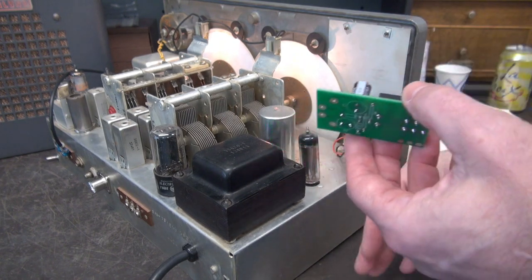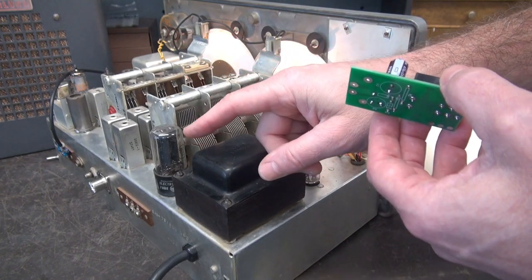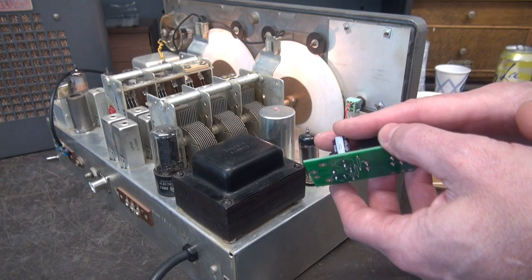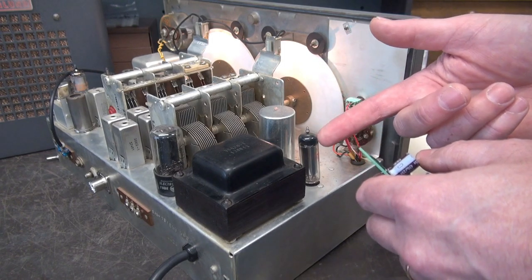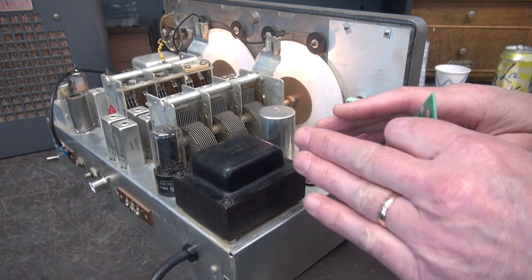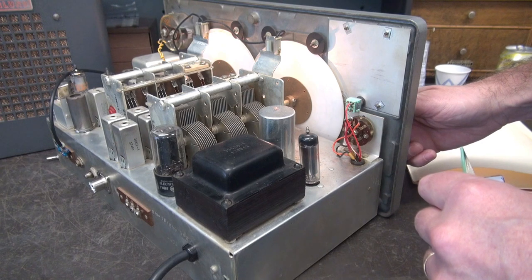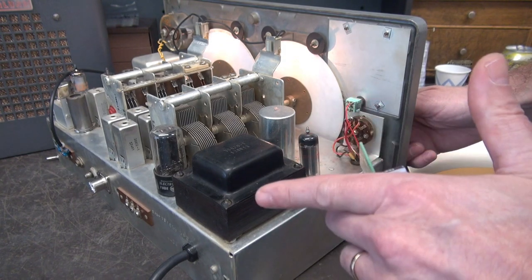My K1S switching circuit board. This little board will reside underneath the chassis of your receiver. You'll simply have an RCA jack on the back panel that you ground, and that activates this board. The switching method I'm using is adopted from the National 300 receiver — on that receiver they don't interrupt high voltage. They simply raise the ground of your RF gain pot and the cathode of the 6AQ5 audio output tube, giving you great muting function, nice and quiet, without interrupting high voltage. So this front selector switch will still operate as before; we're not getting into the high voltage at all. We're simply going to raise grounds and give this radio external muting.